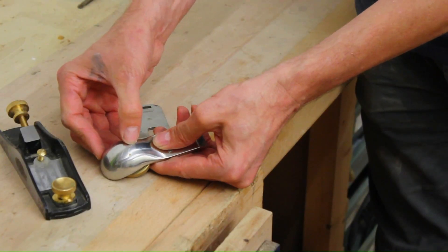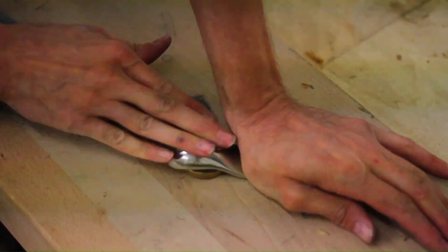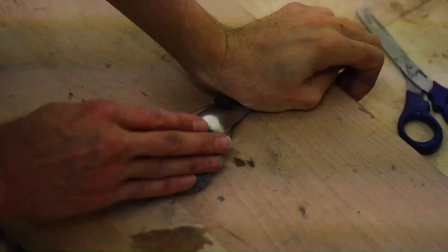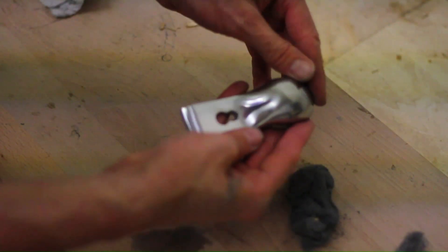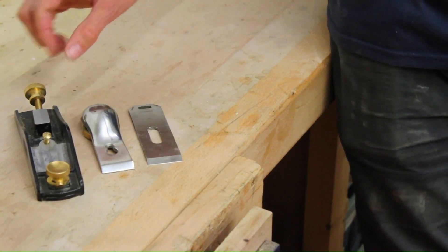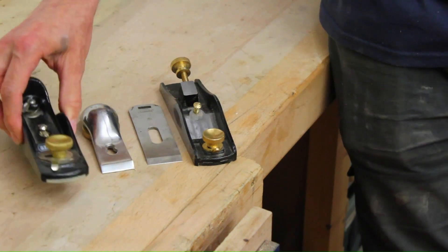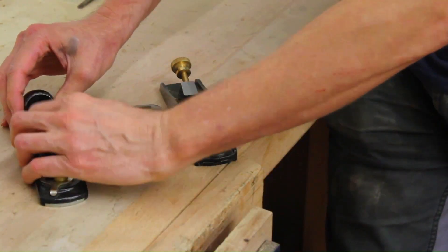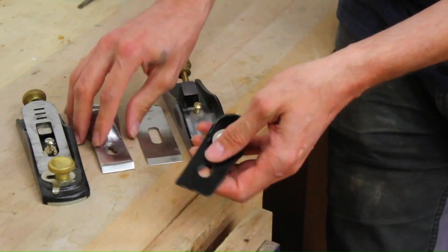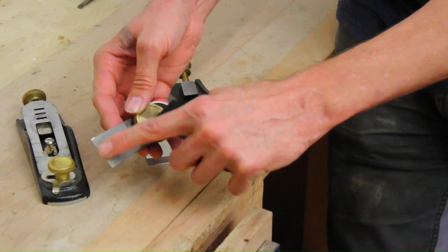It looks like there's a bit of glue on here which needs to come off. But I think after a bit of restoration work, it's a really nice tool to be fair, and I think I prefer it to the Stanley. Now the adjustment on the Stanley — you undo that and that pops up. And that hasn't got a ground surface like the Chinese tool has; the Chinese tool has a flat ground onto it there.